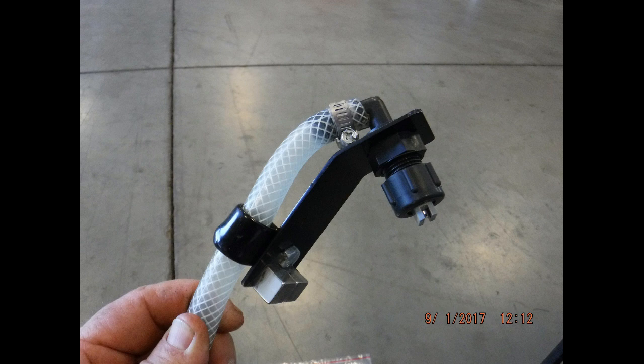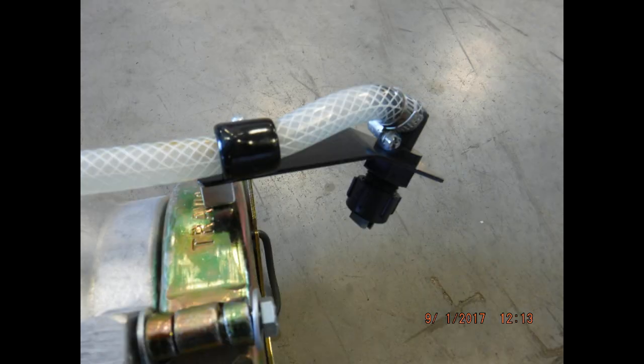At the end of the spray hose is a standard nozzle assembly with replaceable tips. We always use steel insert tips or solid steel tips due to the abrasive nature of the soil biology boost. The assembly has some magnets on the bracket that can be used to fasten the spray tip to the base of an auger and treat the seed as it is pulled in and loaded.